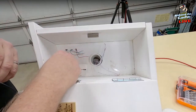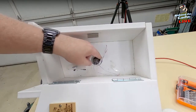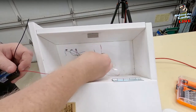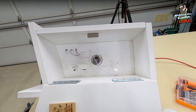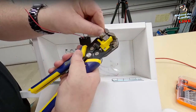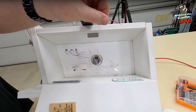Like I said before, the color on these LEDs is the negative. So I'm going to go ahead and wire up that first because the other end is going to be going to the reed switch. Then we'll take the positive and run it into one side of the reed switch, and then the other part of the reed switch will come into each one of the LEDs. I'm going to be using the solder sleeve. And I love — Chad got me started on these wire tools — so it's actually a lot easier than pulling the wires apart.